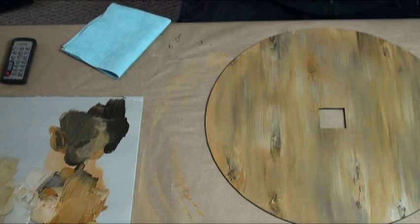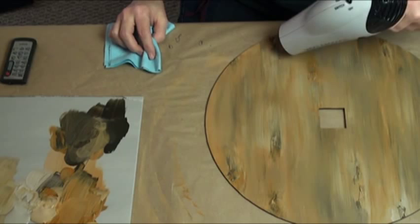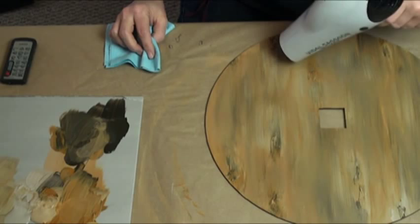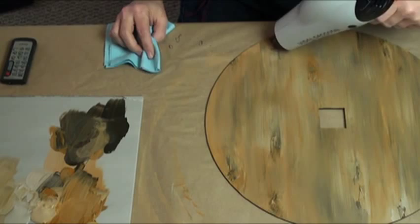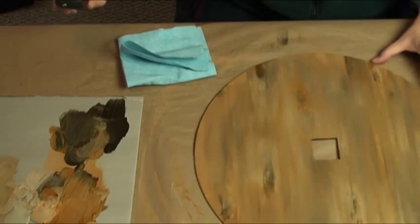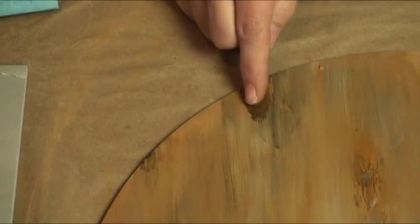Now I've got this dry, so now I'll hit each of these spots on hot until the wax liquefies, and then I'll wipe it off. What that does is it gives us a really, really good rough little edge right there - just like it's worn off or whatever. Don't wipe into the surface if you can because that will spread wax everywhere. We need to keep the wax off because paint won't stick to wax.